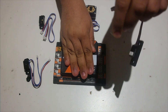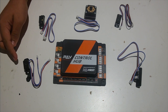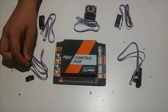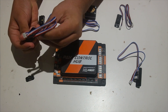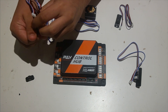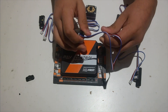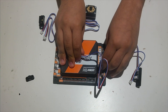Another sensor very similar to the touch sensor is the magnetic limit switch. It's the same type of sensor as a touch sensor in that it gives the same exact output, except it uses a magnetic mechanism — it's a different type of sensor but uses the same output. So the first step again is to plug in the cable, and it goes into the digital ports, the same ones that touch sensors go into.